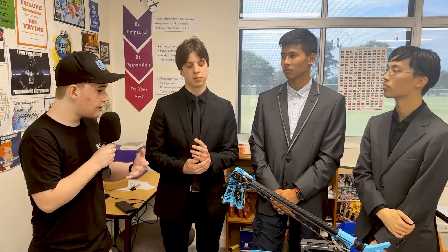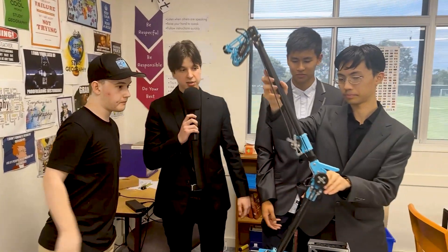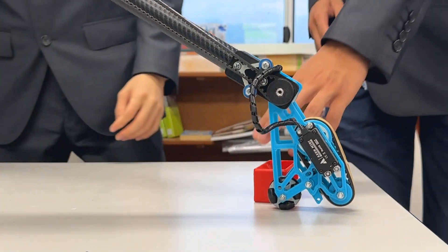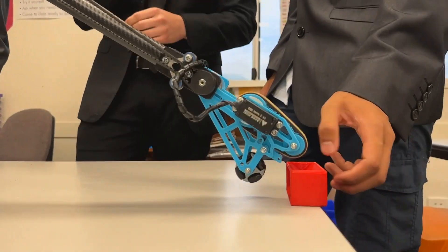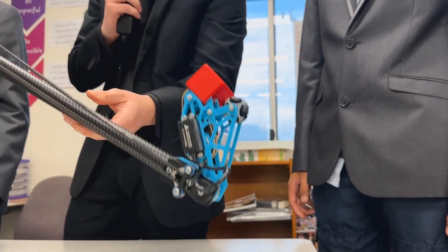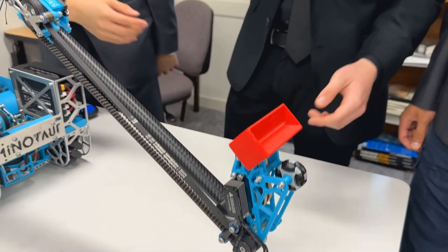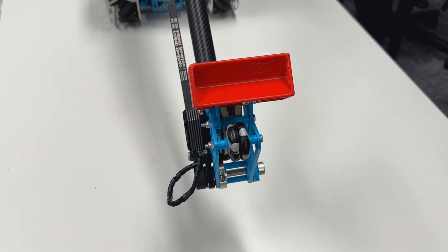One final question is how have you found that the active intake worked for you? Yeah, so going into the season we wanted to just do a claw, like I think Gear Wizards has one, very similar. But what we found is with the backlash on the arm, that's been a pretty big issue and it meant that we've had issues aligning properly. So instead we opted for the active design, which gave us a little bit more flexibility with those angles. And that wheel is another kind of preventative for backlash — we can run with the arm just against the ground with the wheel, which means we've got a very constant intaking height. The active intake has really saved the season.